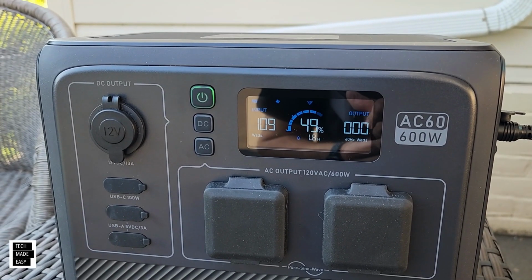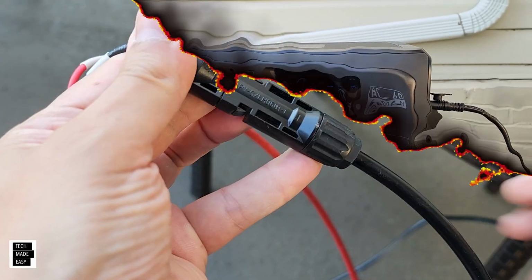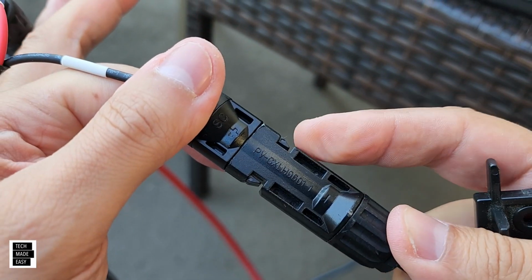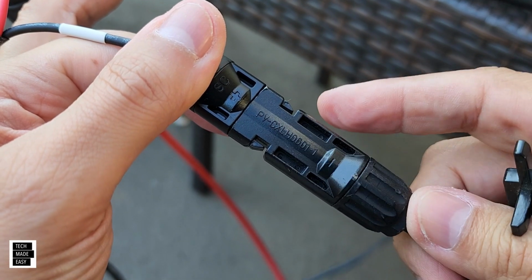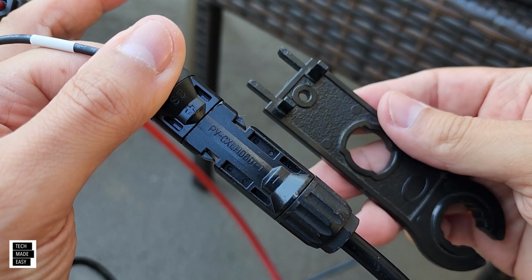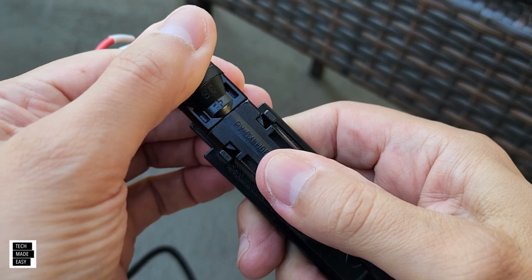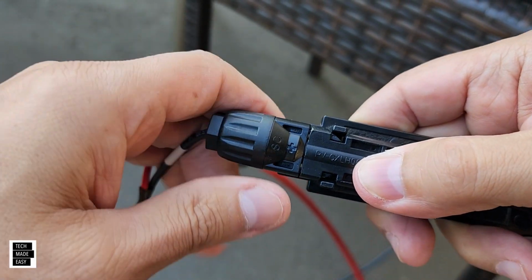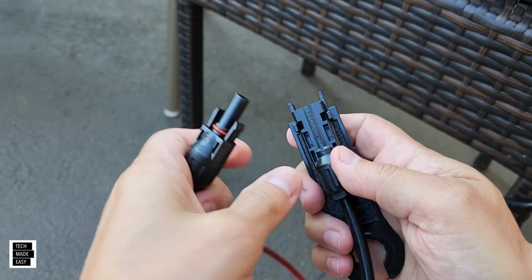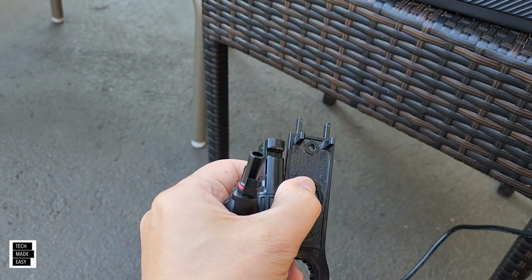Let's go ahead and show you how to disconnect the solar cables real quick. Here's one of the solar cables, and you can see it's got two pins right here. This little guy, basically an inexpensive tool, we'll put links in the description, just goes underneath it, pushes the pins in, and by doing so, you can disconnect the solar cable. So, not bad. Again, we'll put links in the description, and there's our solar test.